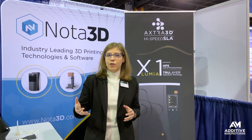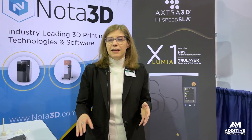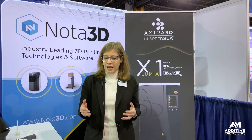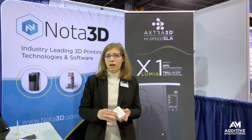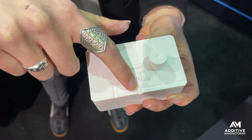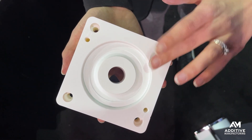This tool was used to produce between 300 and 500 runs of these caps in polypropylene and polycarbonate — maybe as many as a thousand parts off of one of these ceramic molds. It's not a mass production situation, but it is enough quantity for a prototyping run or a bridge production situation. These molds will wear out over time, especially depending on the geometry and the abrasion of the material being injection molded.